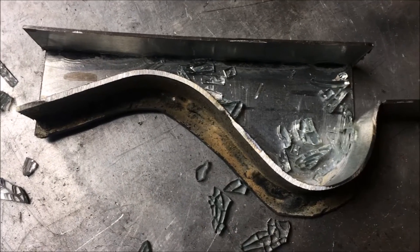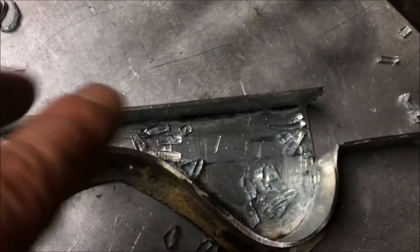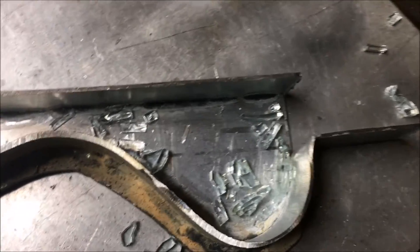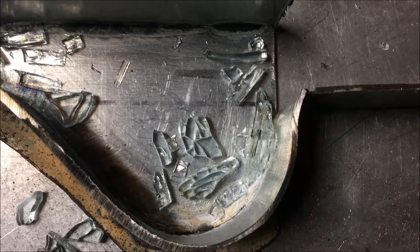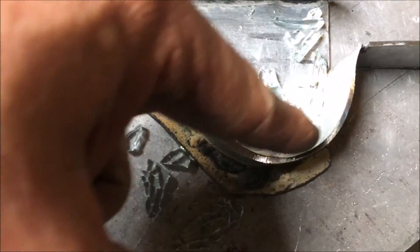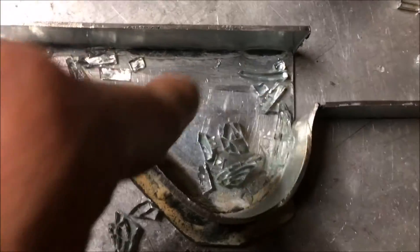I really should have looked at it through a thermal camera. That might not have helped much, but a waste oil burner might react a little bit differently — there's going to be a lot more fuel coming into the situation. It's hard to say if I'm going to get the swirl I want or not. It's not looking good so far; it looks like I need to put some kind of secondary baffle in there. The air may be coming in this way and dropping down. I need to get a tumble going in here — that's my objective.